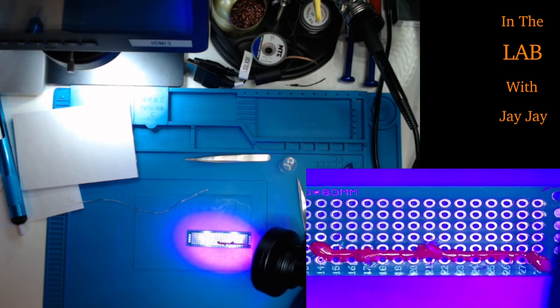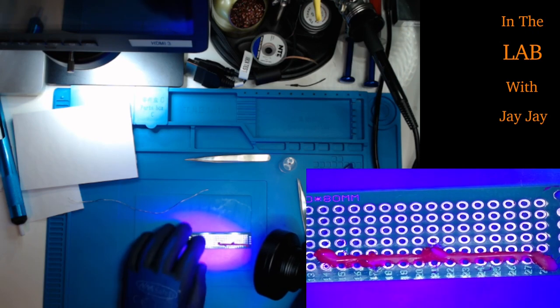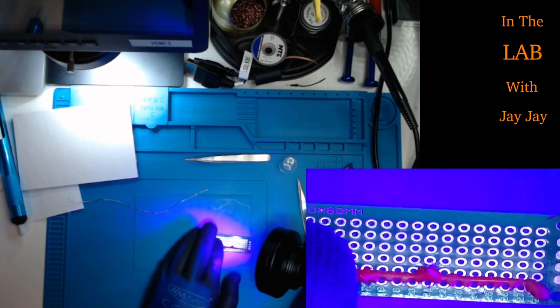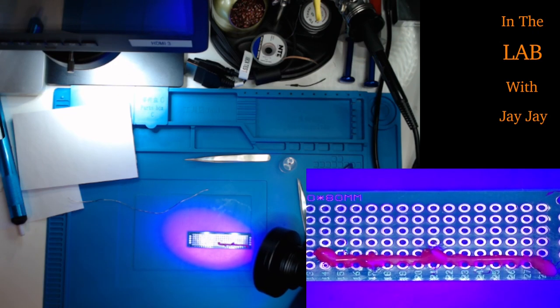I really have no experience with this solder mask. I don't know how long you really expect to keep it exposed. I did read somewhere that it's from a few seconds to a few minutes, so that seems to be about the way of it. I don't think you need to do it for hours. So if we run our finger across there now, you'll see it's gone kind of matte. That sheen's come off it, and it's sort of firmed up. So that's it. What do you think? It's a pretty good bodge wire. So the small one, the medium one, and the big one. All held in place, all solder masked up.